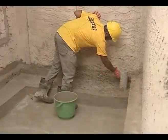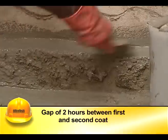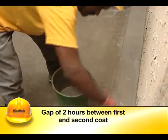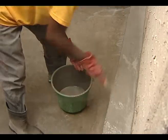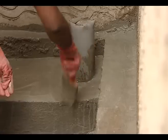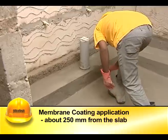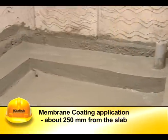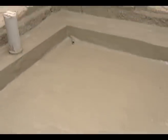The application can be done using a brush with soft bristles. Waterproofing coating is applied in 2 coats with a gap of 2 hours between the 2 coats. The second coat must be applied perpendicular to the first coat. When applying the membrane coating, care shall be taken to treat the joint of slab and wall properly. The portion of the wall to a height of 250 mm from the junction of wall and slab shall also be coated with the product.